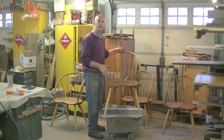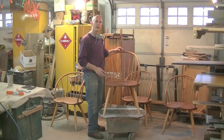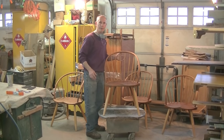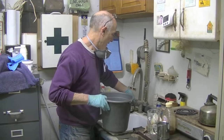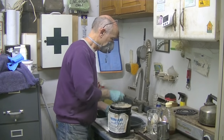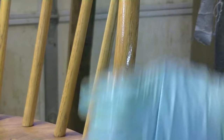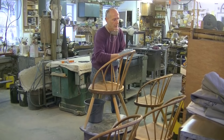I've cleaned these down with the dishwasher detergent. It worked really well — it took the finish right off, right down to the bare wood. Now I'm going to go over it with a mild solution of oxalic acid. There's still grayness where people's hands were, and in a couple of places on these chairs there's a lot of gray damage where some metal came in contact with them. So I'm just going to mix up some oxalic acid in hot water. You can see how the oxalic is brightening up the wood a little bit in areas that didn't seem to come completely clean. There's still a little bit of grayness, but I think this wash will do the trick.